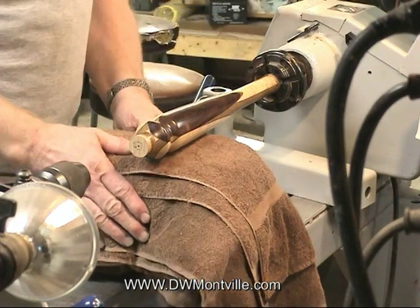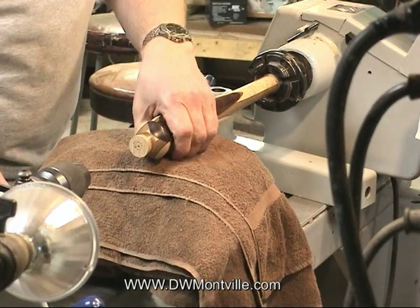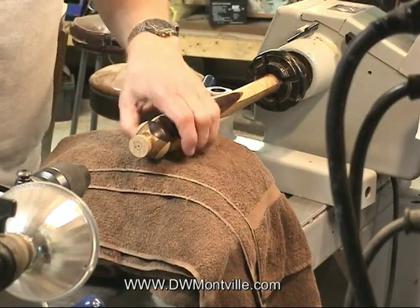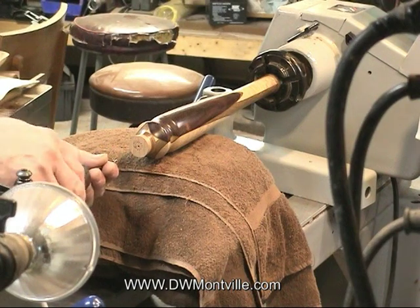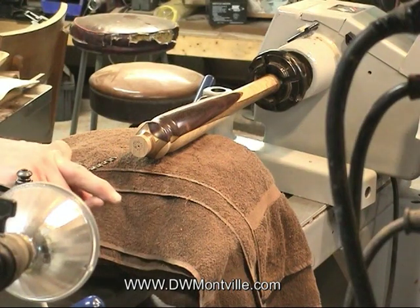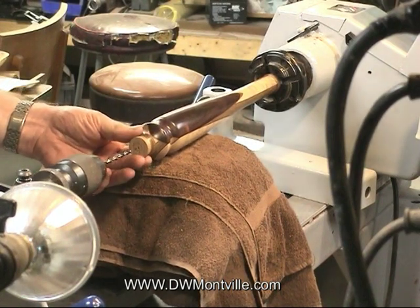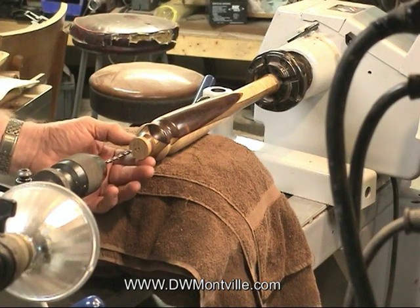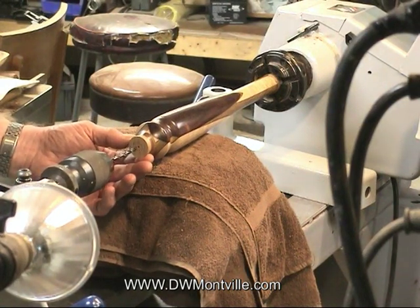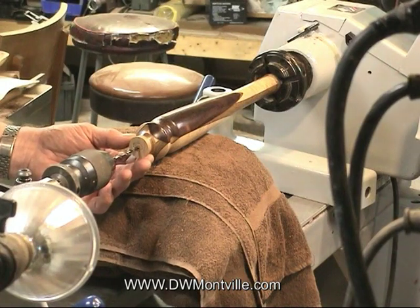I have this little block of wood with a towel on top in case I want to reference it and supply some support. I'm going to put about a 3/16" drill bit in my tailstock and bring it up to the hole that the center left in my waste block, just bring it up to it so I know that I'm really close to center.